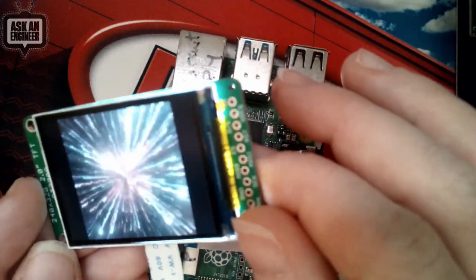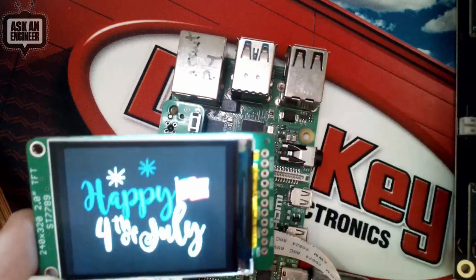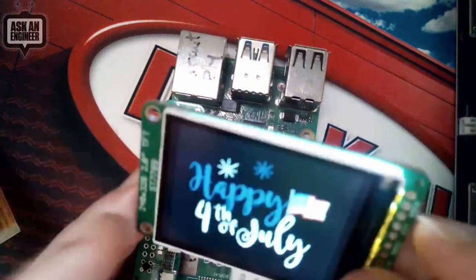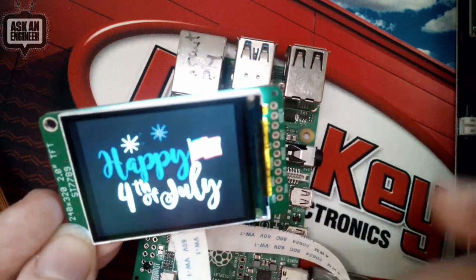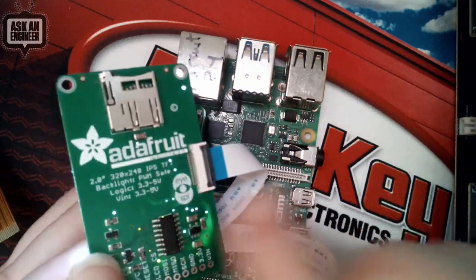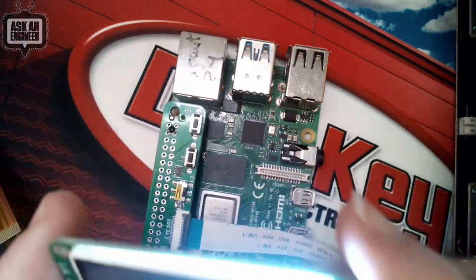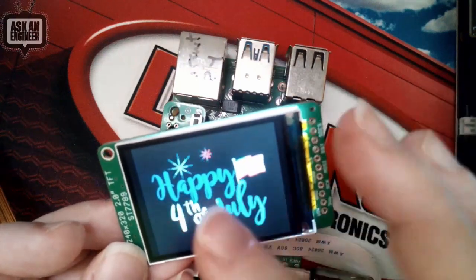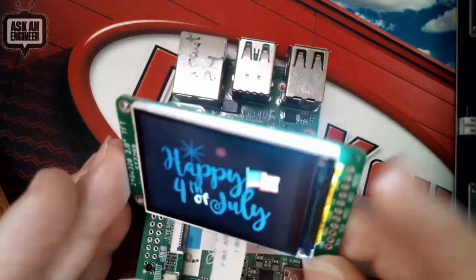But very, very useful for when you want to connect different displays. So good for any of our SPI displays up to 240 by 320, but also many of our E-Ink displays have this connector as well. So also, if you just happen to want to bring those pins out and then connect them to some other device for some reason, we have a breakout for this cable. So you can have it on the breakout and then have the GPIO far away. So this makes for very tidy wiring, much nicer. You'd also, of course, have the kernel console show up here if you wanted a terminal display, or you wanted X to display on it. Very low resolution, but you could do it.